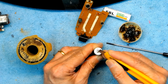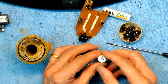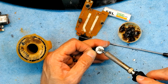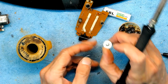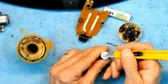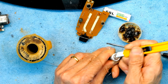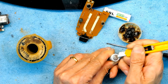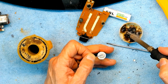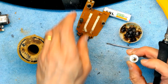The surface of the metal is usually oxidized. When you rub off the surface you get to the part that's not oxidized, and when it's not oxidized it's much easier for the solder to stick to it — no rocket science. The solder stuck very easily. I'm going to do the same thing on the back side so I don't have to overheat it. Do not overheat these — less than one second is enough.